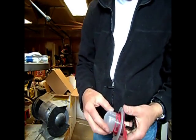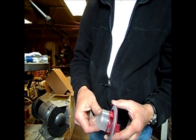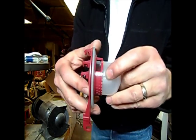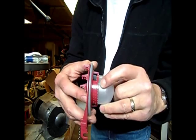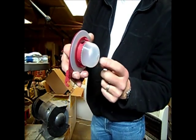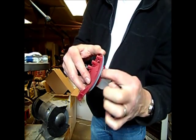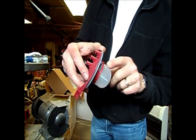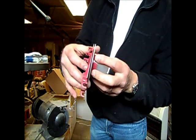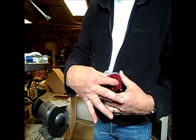Here I just took it out of the toilet. It's set on 1 — I don't like that. What it does is it opens up drain holes in here so water comes out quicker. You close the air off and the water comes out slower, so it stays up in the air longer. So what we'll do is pop this out of here.